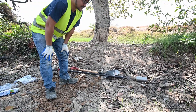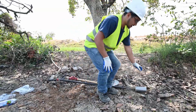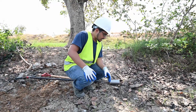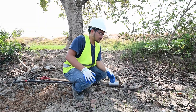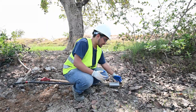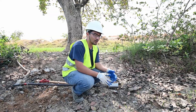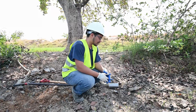All offices will be receiving two types of buckets. The one you see here is a clay bucket — clay buckets are a little bit wider, meaning clay particles and clay samples can enter freely. The sand bucket has a narrow blade so it's a little bit harder for the sample to enter, but the blades cut the sand and it's able to lift into the bucket. The nice thing about the sand bucket is that sand is not able to leave the bucket once it enters, so you're never going to have the hazard of losing samples back into the hole. It's important to know what type of soil you're sampling in order to select the appropriate bucket.